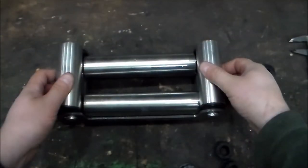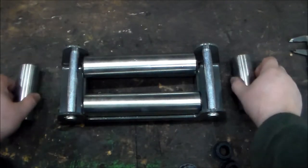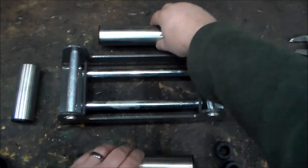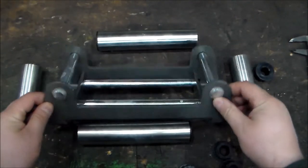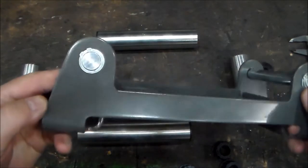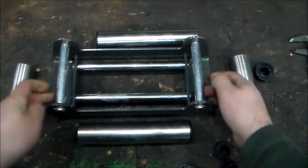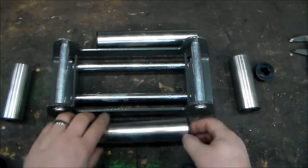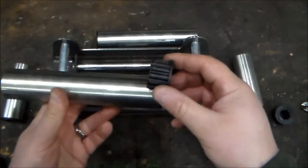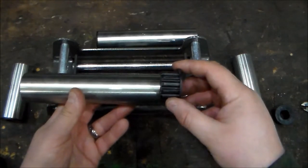So here's the roller guide, and I've already taken the rollers off. You can see here are the central shafts, and all I had to do was loosen the snap ring here, bring in so you can see a little bit better, there, and here, and then the same on the other two, pull them out, and then I got these rollers out. So if you take one of these bushings out, you'll notice it's only about 3/4 inches wide, and everything in between is unsupported.